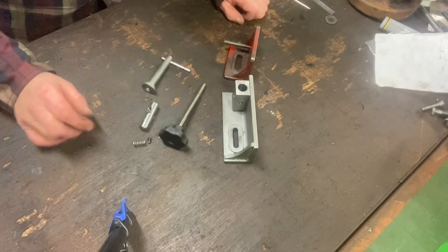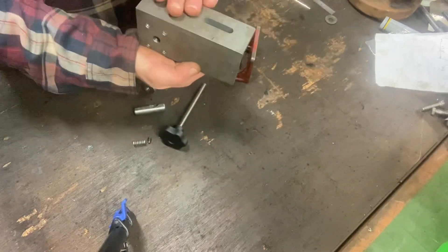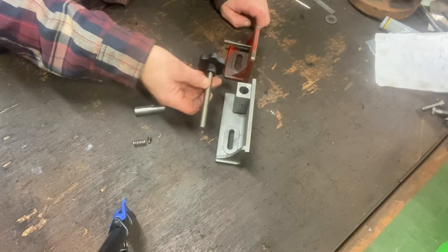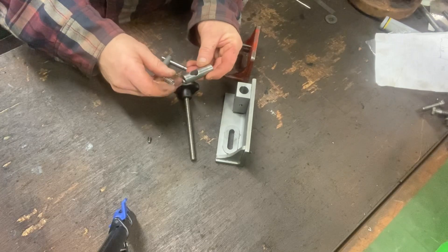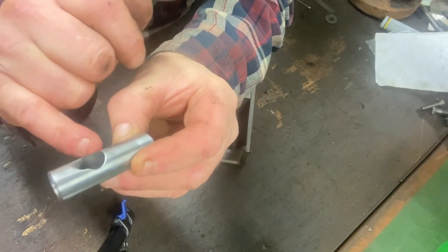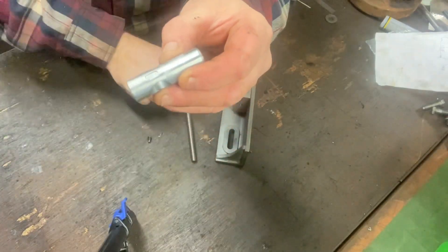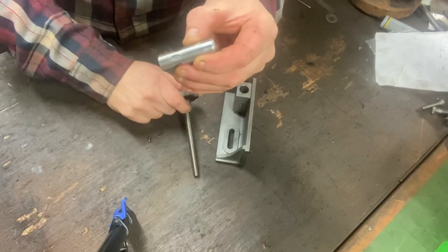So what I've come up with is this system that fits on this jaw. It has been machined square so it's nice and square. This is the new bolt that slides in and out of the locking mechanism. It relies on a spring to push it up to locate it into the thread at the bottom, and the top piece has been machined away so that when you push this down it releases the lead screw so you can push it in and out. I've also added a slot here so that if I ever need to remove the spindle itself — if I'm doing angles and it sticks out too far — it can be removed without this popping out.